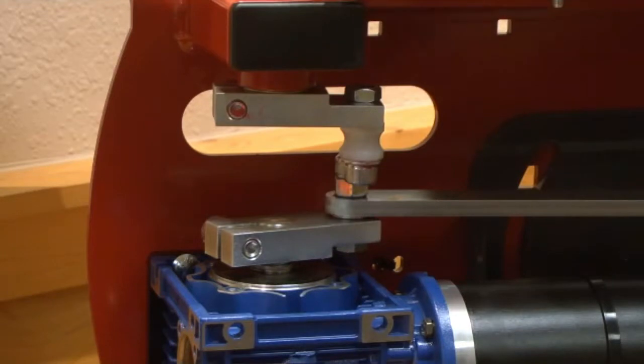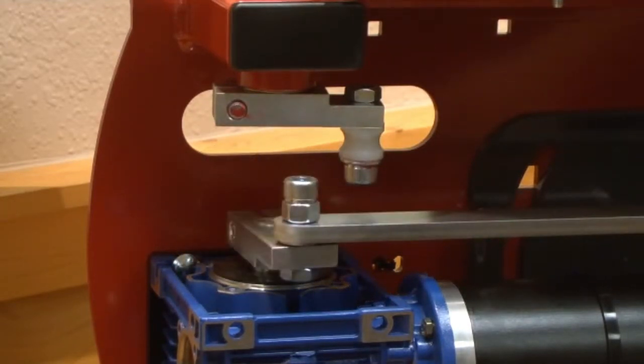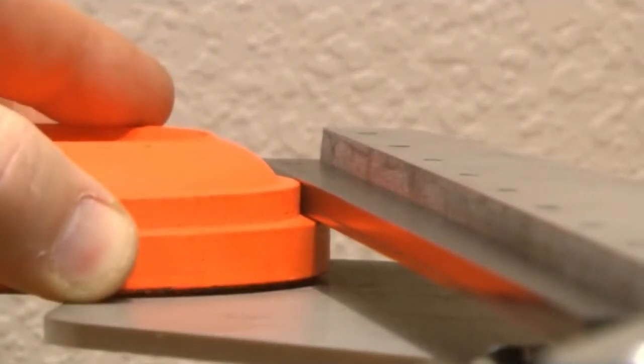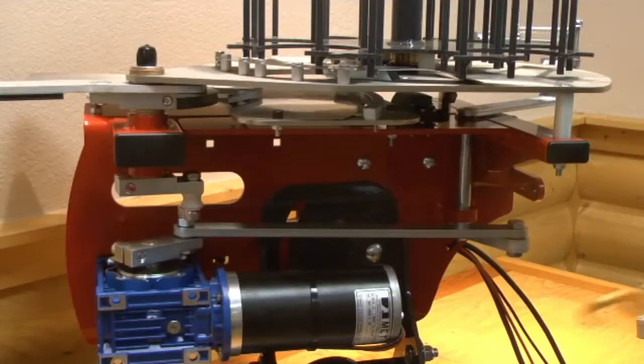It will be necessary to nudge the motor enough so that the arm can rotate around the throwing plate. Once satisfied, make one last check, moving the arm all the way around the throwing plate, checking the height. Refit the main spring.